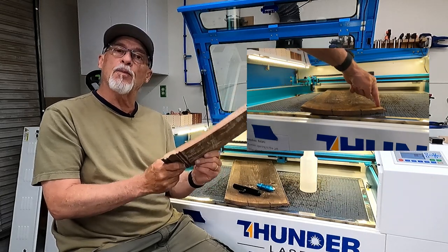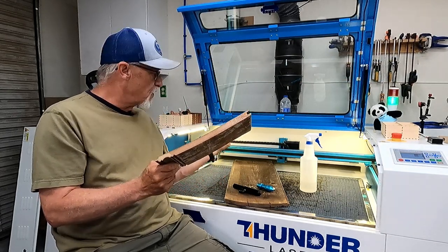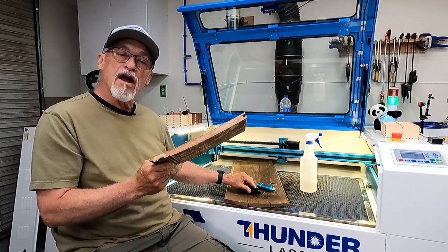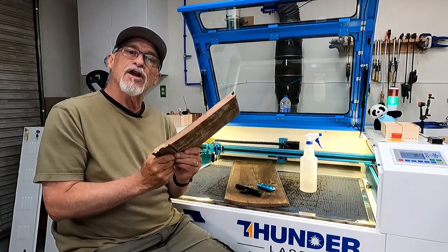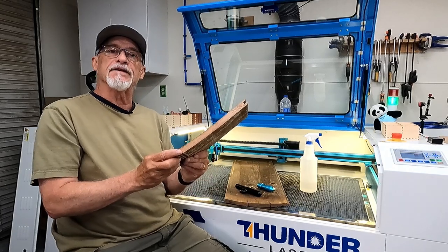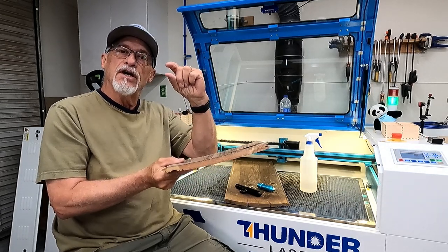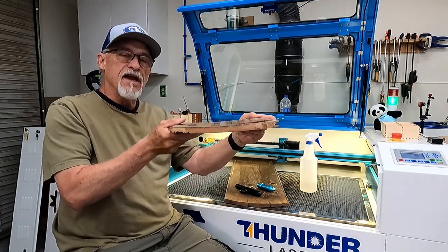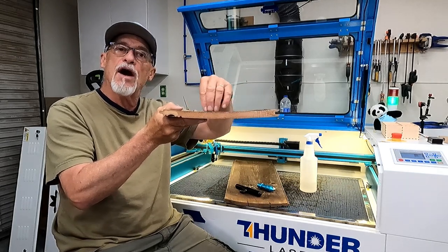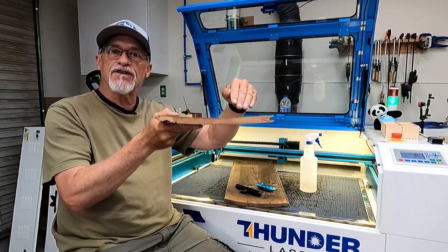This is the kind of stuff that if you know a little bit about your laser lenses, it can help you a bunch. I own three lenses: an inch and a half lens that's on the laser right now that I use for some engraving, the standard two inch lens, and a four inch lens. The only way you're going to be able to do some engraving on wood that's this cupped is to use your four inch lens. The four inch lens has the largest in-focus area compared to the rest of the lenses.